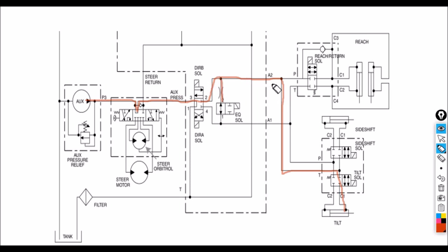Because this is a tilting operation, the equalization valve would be energized, closing the path between the two over-mast hoses. But when we're trying to retract the tilt cylinder, hydraulic pressure would also be present here. If this was working correctly, the one-way check valve would prevent hydraulic flow from reaching the piston end of the reach cylinder. But if this one-way check valve is always open, there is a path to the piston end of the reach cylinder, causing it to try to extend itself.